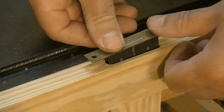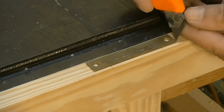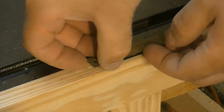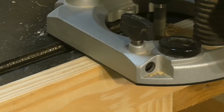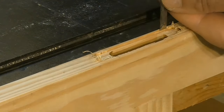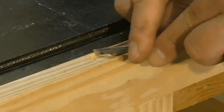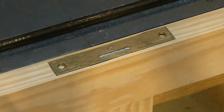Now I use a cutter to cut the wood all around the lock faceplate. And I route the faceplate mortise. Well, to finish the faceplate mortise, I must use a chisel. And now this lock fits perfect. In the link in the description, you can watch in more detail how I install a full mortise lock.